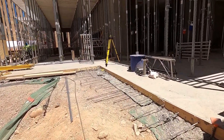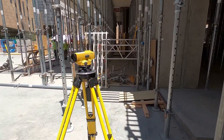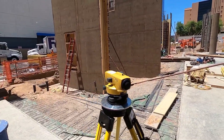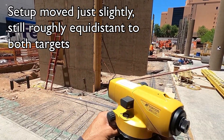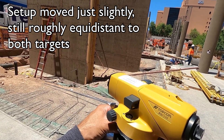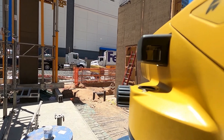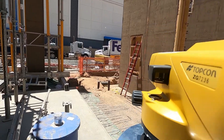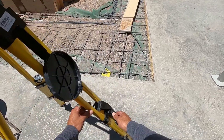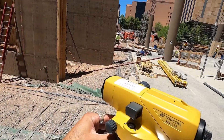Now we've set our foresight, but we're only halfway done with the process — we need to close this level loop. Just like any other level loop, whether we're setting two elevations that are different or transferring elevations using the level line inside the level, we're still going to break our setup, or kick a leg, or whatever term you're used to hearing. I'll go ahead and level up again. I'm about two hundredths high, so I'll adjust all three legs down two hundredths and level up my instrument again.